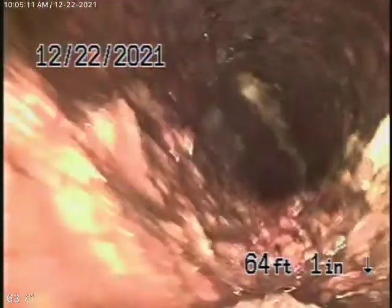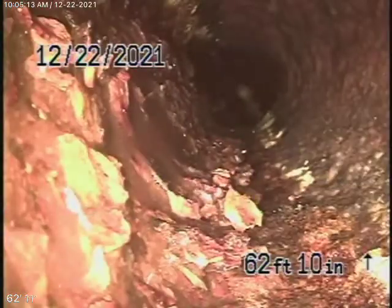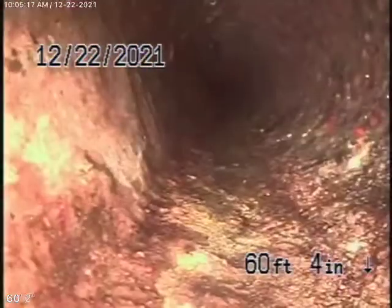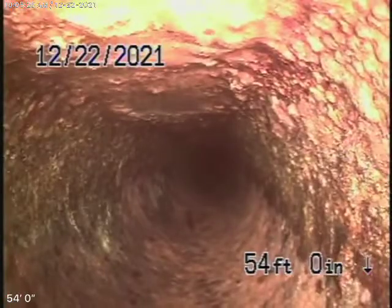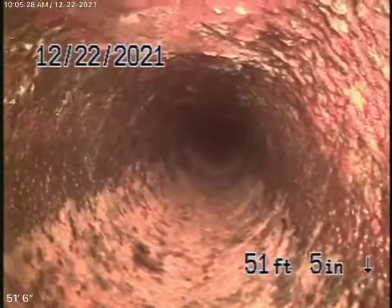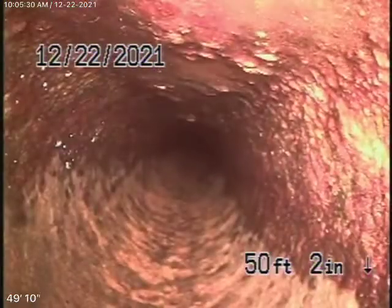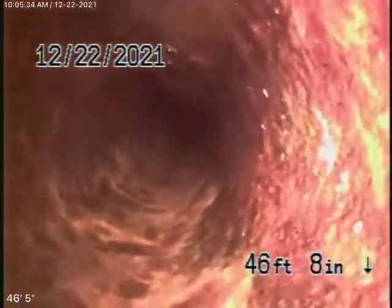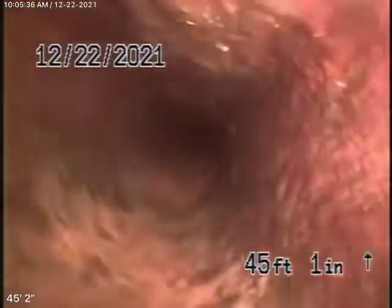It takes a turn here, and around about this area over here is where it exits the property. So we would highly recommend that you do redo the plumbing: go to the property line, get rid of all this pipe, and put a clean out at the end there. Call us, we'll come and run a cable with a blade and a camera, and we'll descale the pipe as best as possible until replacement is obviously necessary. But like I said, it definitely can be maintained, that's my opinion.